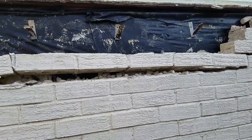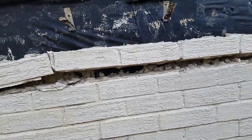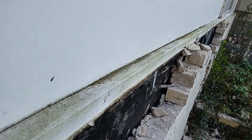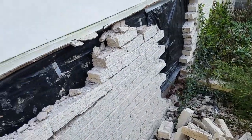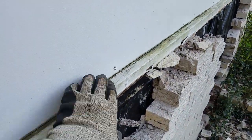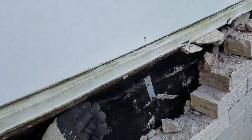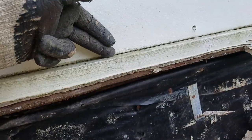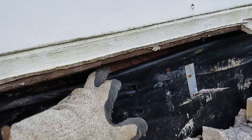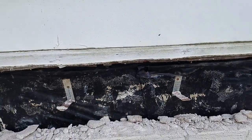One of the reasons why all this damage actually occurred is you can see the pitch on this drip edge here — it's not properly done and it actually leans back. There was plastic right here, and as water dripped down behind it, it got behind the plastic and actually rotted everything out.